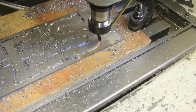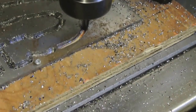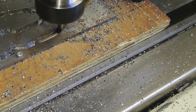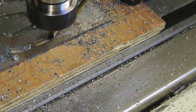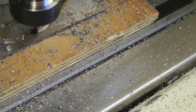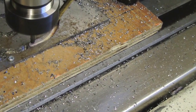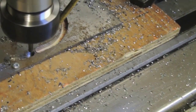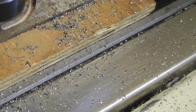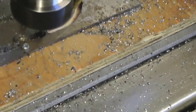Right here you can see the wood - the one underneath. I had to do a little bit of fiddling with the depth settings. I didn't want it leaving too far proud there, so I just told it to go slightly deeper into the wood and slightly shallower in the cut. Of course it goes deeper. We'll see what happens at the end because that's going to go right through. I don't think there's much more metal there. It looks nice.